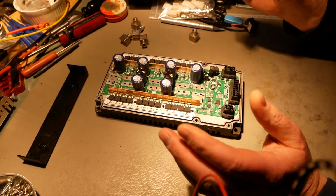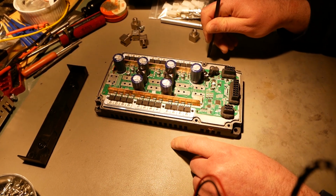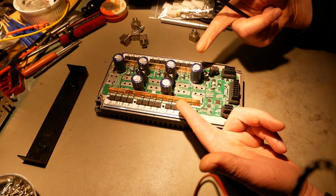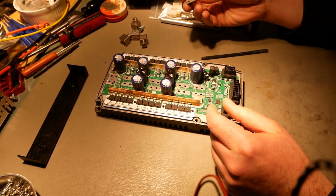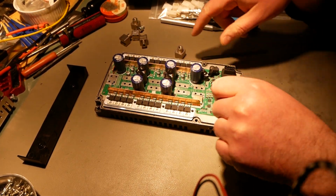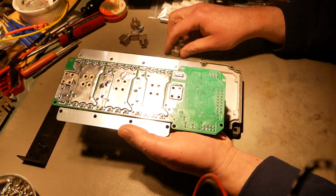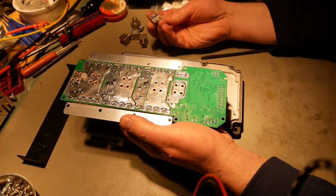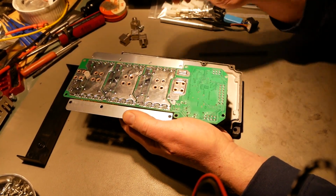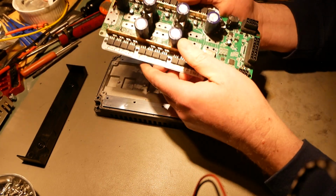Anyway, yeah, Mike over at evperformance.nl, thank you for sending this to me. I am pleasantly surprised by the build quality here. This is pretty darn good. And as you can see, this is a lot of surface area screwed down to 2 large pads and reinforced on the backside by a boatload of copper. And that's true for all 5 of these. And they're screwed down with 4 M3 screws each. This isn't going anywhere. This is really good, really sound, solid build.